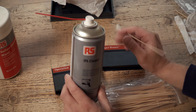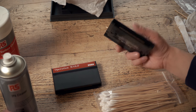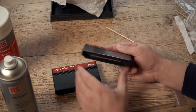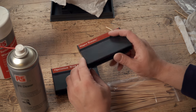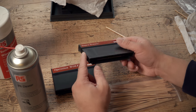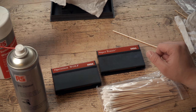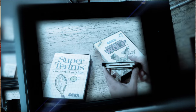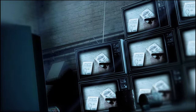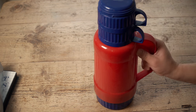This all applies to anything with edge connectors on it, or anything that needs a connection — not just Sega Master System and 8-bit and 16-bit cartridges. Even my Spectrum Plus 3: when the reset button stopped working, I squirted it with isopropyl, left it to dry, and it worked beautifully afterwards. Because it evaporates so quickly. One vital thing: don't immediately put it back into your console — let it dry for 15 minutes. Any kind of moisture and electronics aren't good to combine. So I hope that was useful to anyone having problems with their games cartridges. And no, I haven't forgotten — you can drink your weak lemon drink now.